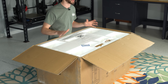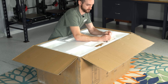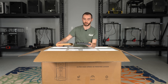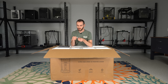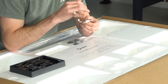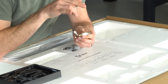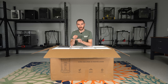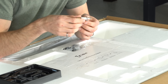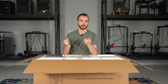So immediately I'm seeing some hollow cavities here with nothing in them. The box isn't completely packed to the brim, but they've padded it very well so it doesn't get damaged during shipping. We have 500 grams of high-speed PLA, and here's a box with some tools in it. The one thing worth talking about is a complete hotend assembly, and this looks quite unlike anything I've seen on any other printer I've owned. It has a really big ceramic heating core, looks like a bimetallic heat break, and the actual melt zone is ginormous — even bigger than your standard Volcano. It's got what looks to be a standard V6 thread on the nozzle, though the geometry looks a little unique so it may or may not be proprietary. It's very interesting to see what a 110 mm³/s hotend looks like.